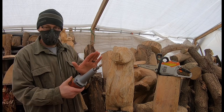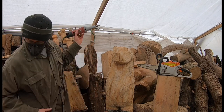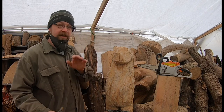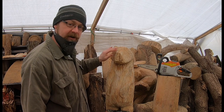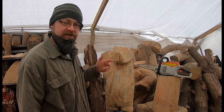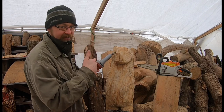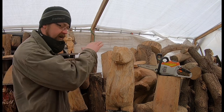I've got the half-inch flame bit in my die grinder and we're good to go. What I like to do is start kind of at the top, come in at an angle, and start rounding my eye. You guys could take a pencil or crayon and give yourself a rough line or rough size and draw it on. I just don't do it because I can never draw them to match, so I just get on here, start a rough circle, start making it smaller, and just eyeball the eyeballs. Let me zoom in a little bit closer and we'll start actually cutting some wood.